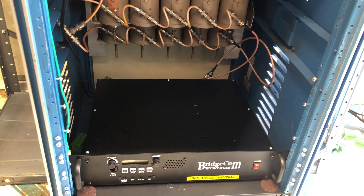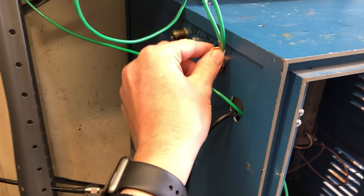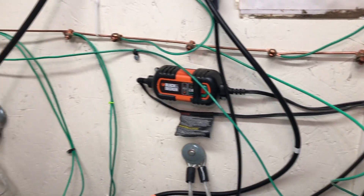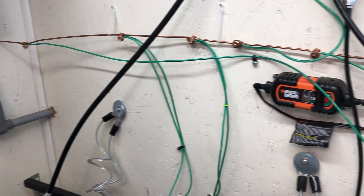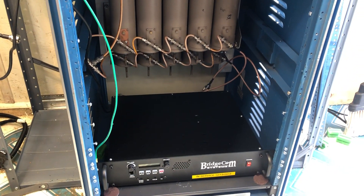There's more grounding — one from the repeater here, one to the outside. The polyphaser is mounted on, and this will go up to the other grounding strap that goes in here, out the top, and then it's all tied together. End result should be a pretty sweet running repeater.